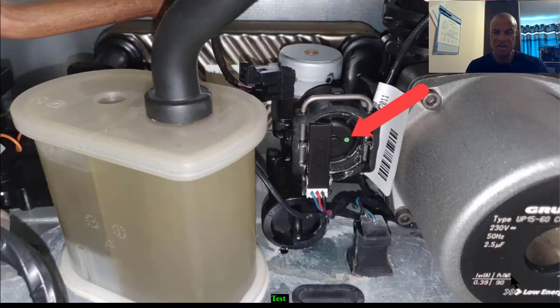This is the flow turbine. This particular one is quite a small, special one — most of them are quite big and some are made from brass, but this is a small plastic one. You basically have to remove the clip, which you pull upwards, and also remove the electrical plug downwards, and then we can proceed to remove the flow turbine.